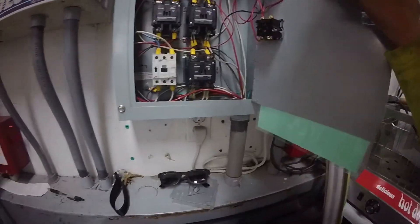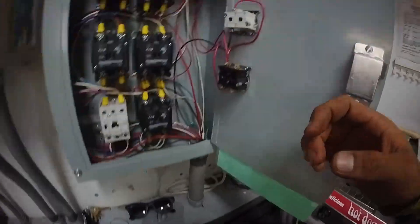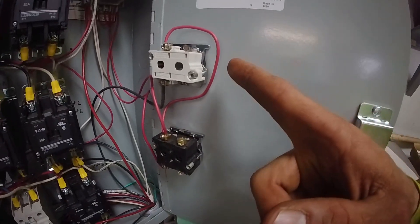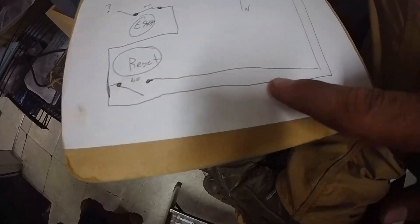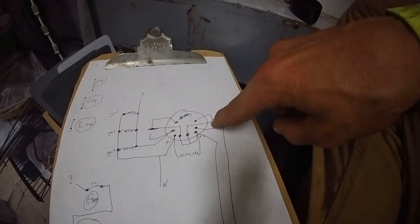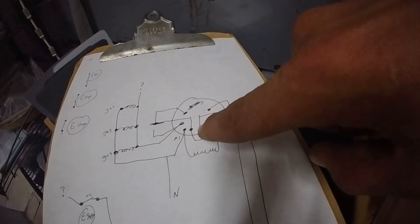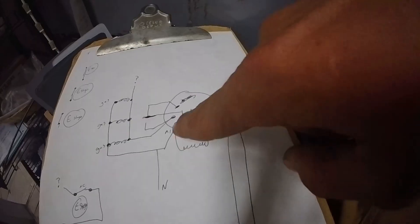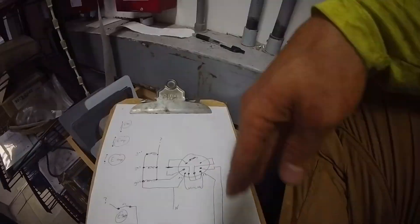You'll have a ton of experience with contactors if you watch my videos. We have an e-stop button on this panel and a reset button. Right now we have 120 volts coming from this wire, going through the normally closed emergency switch, carrying the power all the way to this point. From here this is a normally open contact, and right now the relay is in the on position — meaning the contacts are touching. The 120 is being carried across this bridge because it's powered, then powering these three terminals. The 120 is being carried through here and actually into its own coil, powering itself — it's powering itself in an endless feedback loop.